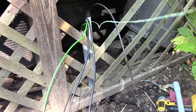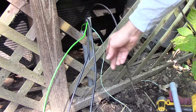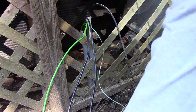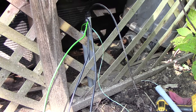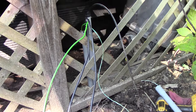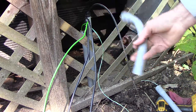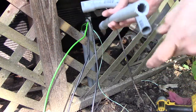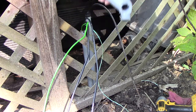So we're up here at the house end. I got these pipes secured with a piece of blocking at the bottom and I'm going to come up — you can finally buy 90-degree elbows in this town again. So I'm going to 90-degree it up at the top and take it back towards the house. I don't know how much I'm going to be able to film the crawl space and under the deck, but I'm going to feed it through the pieces I put in there instead of trying to run the pipe and then pull it — I'll just feed the wire through and then glue it.